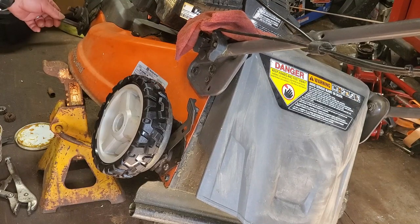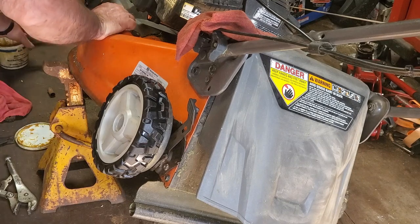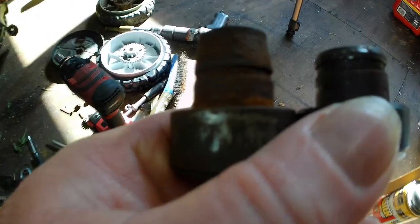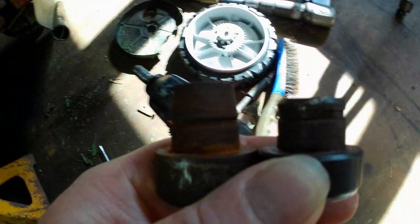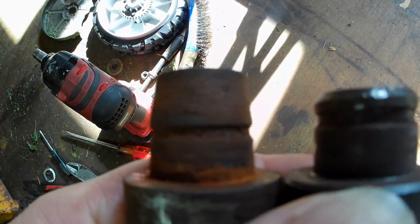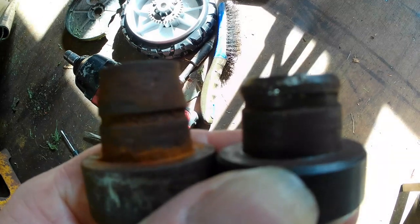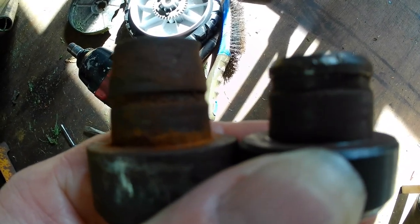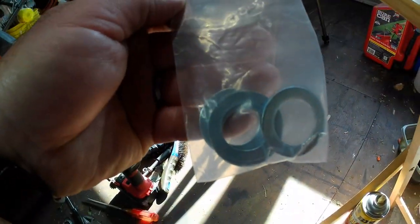In the next clip I'm going to show you the bearings. The replacement ones are a little bit different, maybe a different manufacturer, and they're the only ones I could find. The spacing was off for the slot. I found some shims at Tractor Supply that worked just right. Here we have the new part and the old part. Where the snap ring fits - the old one on the left is closer to the shoulder. The new one has a little bit more space there, so we need to take up that space to make the shaft tight so the wheel doesn't flop around. So I bought some washers at Tractor Supply.